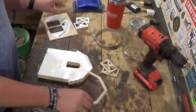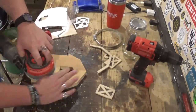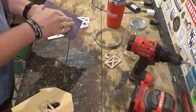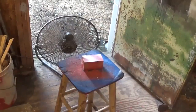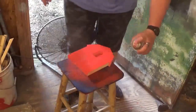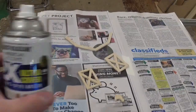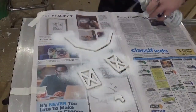Once we come around this side, all of the scroll work will be done. We'll head back over to the workbench, remove the pieces from the waste wood, and begin sanding with the random orbit sander and 100-grit, then hand sand everything else also with 100-grit sandpaper. Then it's time for painting — I painted the barn body a nice bright red color, which is traditional, and painted all of the trim work white, going back and giving those several coats and letting them dry thoroughly.